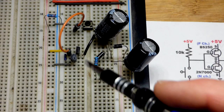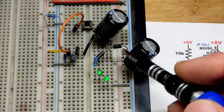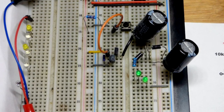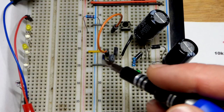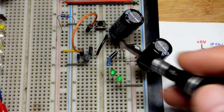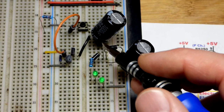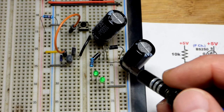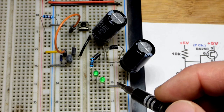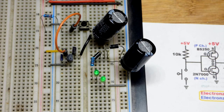This circuit is called a voltage doubler because you get almost twice the voltage, but not quite. We have two diodes, so when charging the charge pump capacitor through the transistors connected to ground, it has to go through that diode — so it won't get all the way up to 5 volts, probably a little more than 4. Then going to the positive supply, we have 5 volts on that side of the capacitor relative to ground, so their voltages add up — maybe around 9.5 volts total, but it's got to go through that diode, so maybe we'll get the output capacitor up to about 9 volts. With a load taking away current, if you go rapid enough, maybe you get to about 9 volts — not quite 10, but close to double.